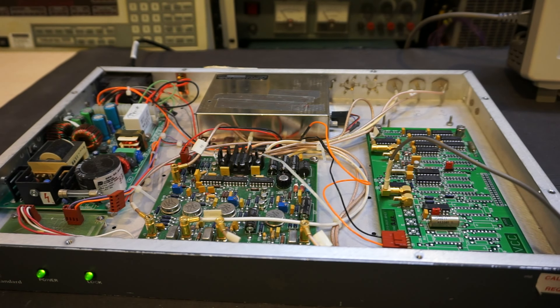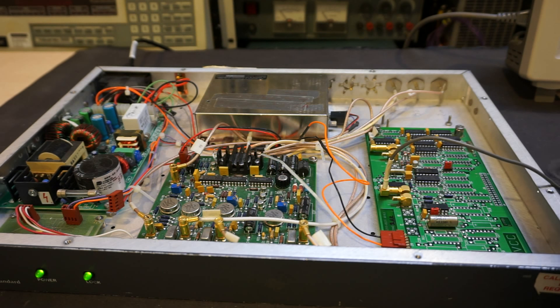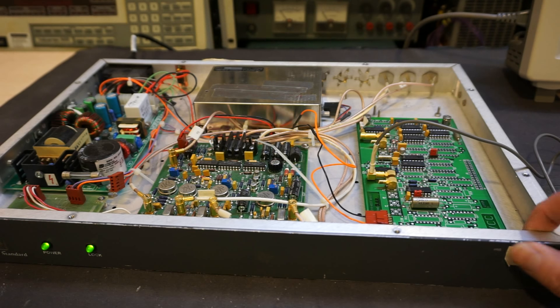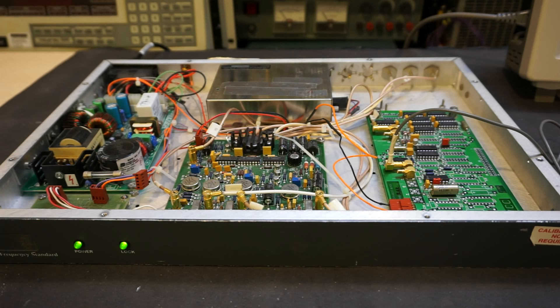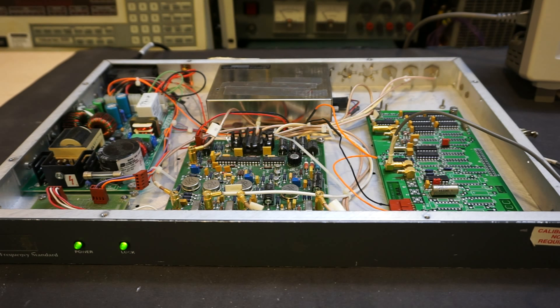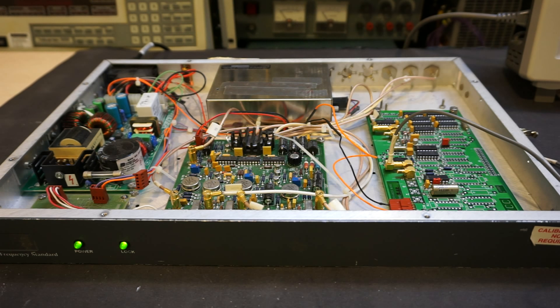At some point I will make a pulse expander so I can use this one-pulse-per-second output to trigger an expander circuit that makes the pulse more symmetrical with a higher duty cycle, making it easier to use. I'm also going to bring this output to the rear panel. Since this unit doesn't come with a power switch, I'm going to add one — I don't intend to have it on 24/7, as for my lab use it's only needed occasionally for calibration. So I think that pretty much wraps up this video. For any future modifications I'll definitely make another video. I hope you enjoyed the video — if you did, please give it a thumbs up, remember to subscribe, and I'll catch you next time.